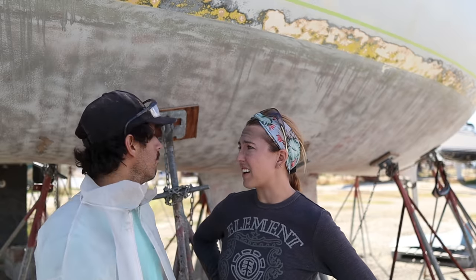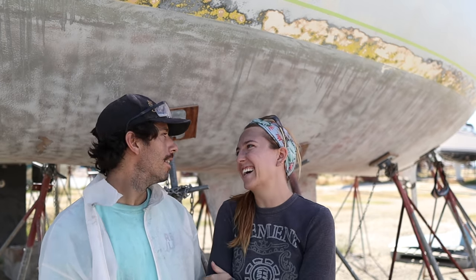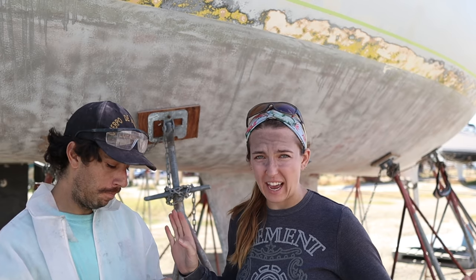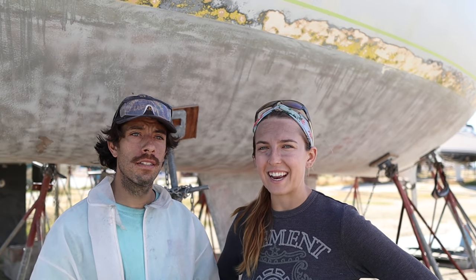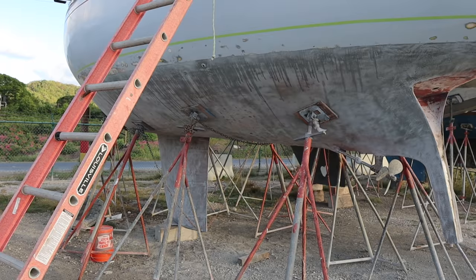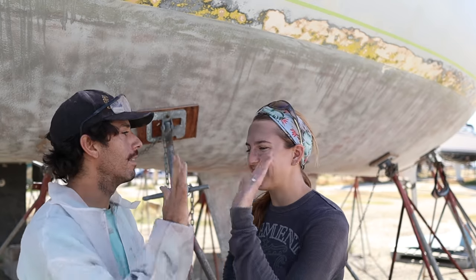I have a serious question now that it's all done and sanded: if you had the money, would you have paid someone to do it? Yeah, definitely, 100%. What we're going to do is rinse it down with water first, then go over it with acetone — we did that last time and it worked really well. Then we get to go on a shopping spree and spend money on bottom paint, which is kind of exciting. Our goal was not only to get all the antifouling off, but also to touch every surface with the rough sander so it wasn't shiny and smooth — because nothing was going to stick to that.